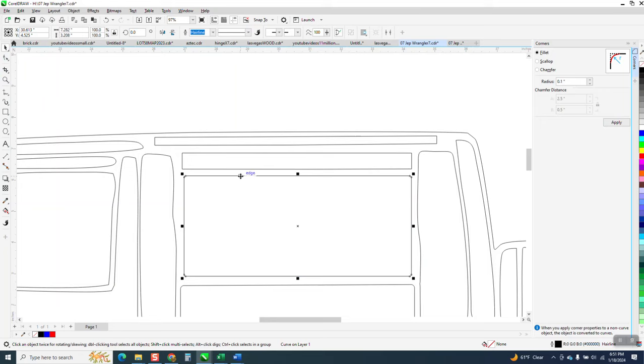For a plasma cutter I'd actually make that like 0.1 — let's see what it looks like. I didn't have it selected. Sometimes when you've made the curve already, it just won't let you do it anymore. There we go, that looks pretty good — that looks like a window. Then I would do both windows the same. You could make them the same length — probably the easiest thing would be to make this one 7.25 inches, and then take this one and make it 7.25. I got my ratio locked, so it's going to slow it down. You could take this and hit L or R, and now those two windows are aligned.